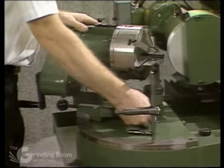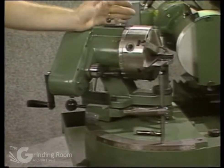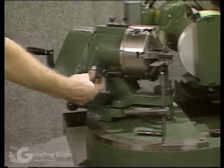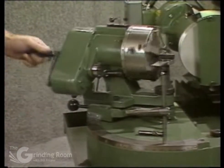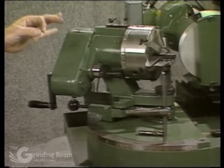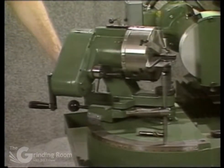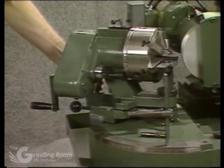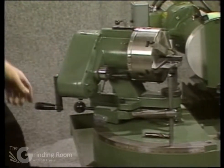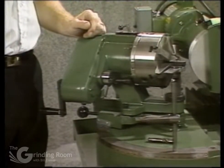Lock the head in place here. And for doing the right-hand drills, use the number 4 cam, which fits right on here. You also use the oscillation on the head — you always use oscillation for drill pointing. For other operations, you do not use the oscillation. The oscillation is engaged by pulling a pin in the back and locking it tight. It should always be locked tight because if it is a little bit loose, the head can wobble slightly and cause chatter on the drill.